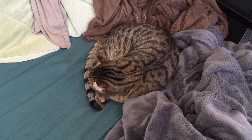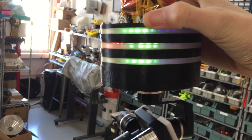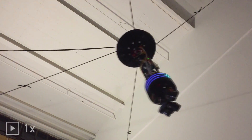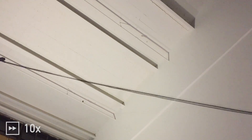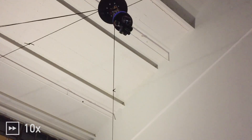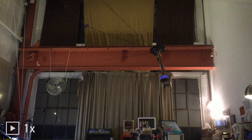Overall stability has been another big question in the current design. The long, half-meter carbon fiber boom in this design is part of a compromise. For the best stability, we'd want the camera and the winch attachments as close as possible to the center of mass. But that would limit how low we could fly the camera without cables bumping into furniture. This design keeps collision avoidance sensors on the very top of the robot near where the cables attach, then the camera drops down half a meter in front of those downward-facing sensors. This design lets the camera fly lower in the room than it otherwise could without a human pilot guiding it. Unfortunately, it also puts the center of mass somewhat below the wire attachment point, so the robot will tend to act like a pendulum.